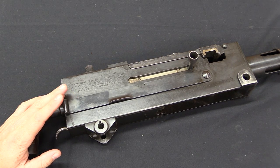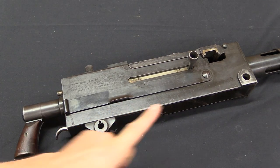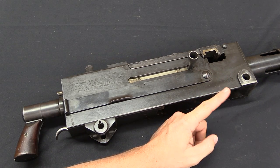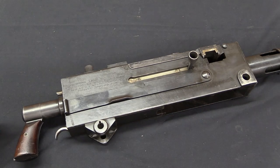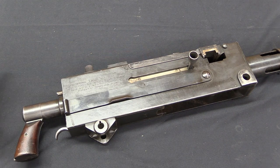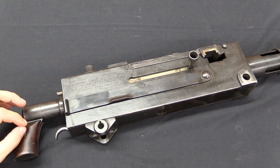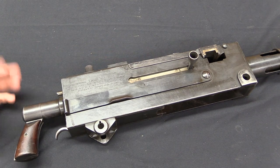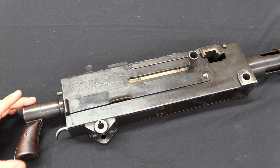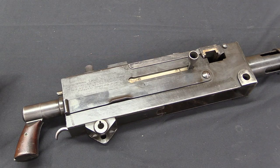Starting at the back — the main concern, even without needing sustained high rate of fire, is that the Browning system fires from a closed bolt. Which means when you are not shooting there is a cartridge in the chamber sitting there. With a machine gun like this you can theoretically have a cook-off: if you shoot enough that the barrel gets so hot that the cartridge sitting in the chamber absorbs that heat, the powder gets hot enough to detonate by itself without having the primer struck. That's a cook-off, that's a problem. The requirement was only that it be able to fire 300 rounds without a cook-off. If you fired 400 or 500 rounds in a single minute, the thing would cook off — but 300 wasn't so much of a problem.